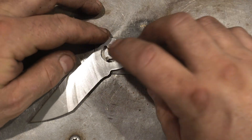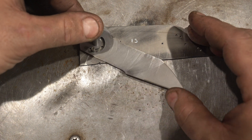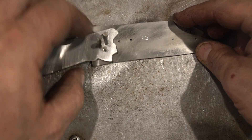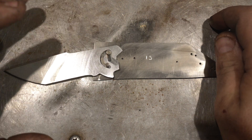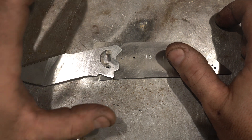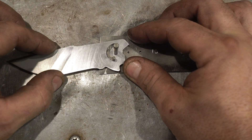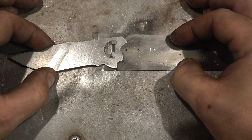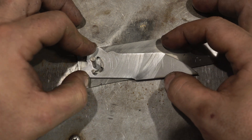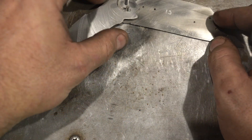We've got our channel milled in. I've placed some dowel pins and tested how it works. You'll notice it stops short — that's intentional — and it doesn't open all the way yet. Keep that steel block fixture set up exactly the same. In small increments, just bump up against the end mill and push it a little, then come back and test, until you get the open and closed position exactly where you want it. We probably need to extend the channel about an eighth of an inch.